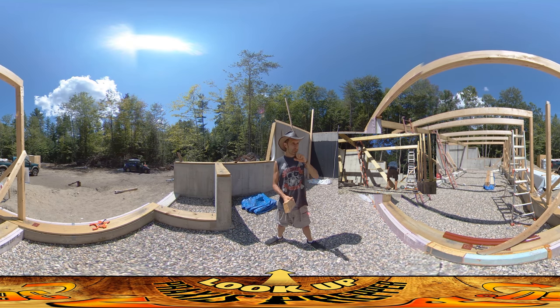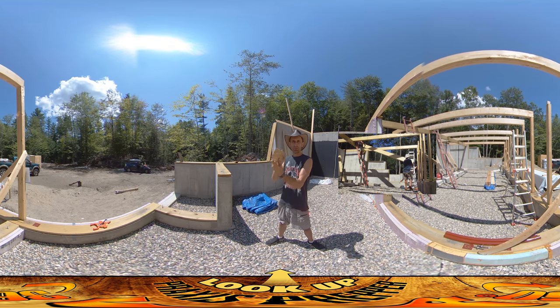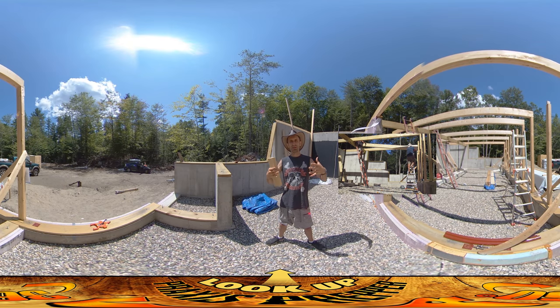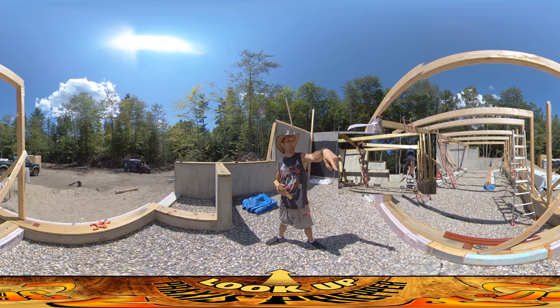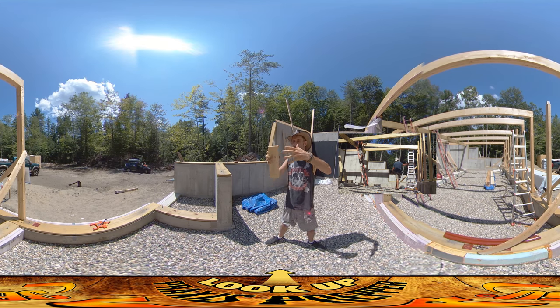The only thing that's been a bit of a challenge has been the gap between the theoretical idea — you know, boards are straight dimensional pieces of lumber — and then the reality of what the lumber actually is. It doesn't always have perfectly square edges; they're rounded, there are splinters, they're not always straight, sometimes they bend, sometimes there's a twist to them. Now that we're starting to interlock a lot of these different pieces, like the floor joists interconnecting with the vertical posts, when things are twisted you kind of have to work with them.